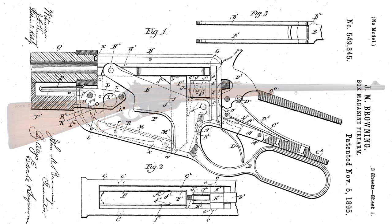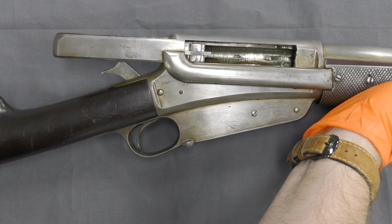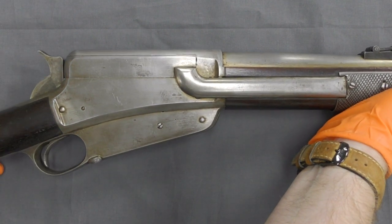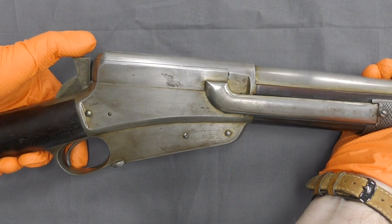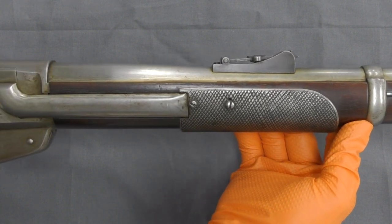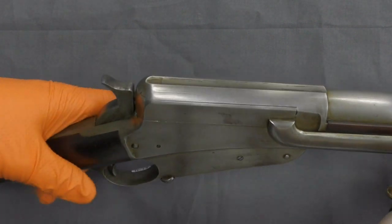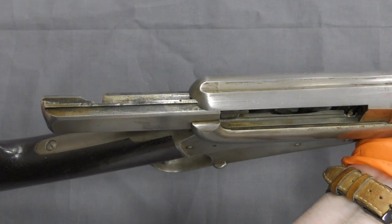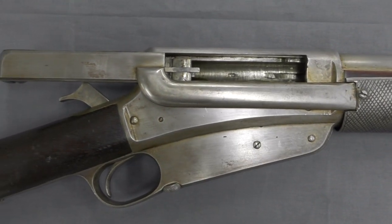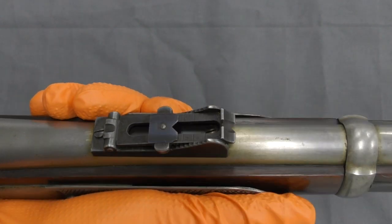The September 1895 slide action rifle design featured a laterally camming locking breech block. Externally, Browning's tool room prototype looks somewhat similar to the contemporary Model 1895, with a single-stack integrated box magazine but with a pump or slide rather than a lever. An action bar connects the slide to the front of the breech block on the right side of the rifle. The slide handle itself is made of a U-shaped piece of metal which wraps around the rifle's forend, with a roughly cross-hatched surface to improve grip. There is a channel cut into the furniture for the action arm's attachment point to travel forwards and backwards, and the slide is attached to the arm by a pair of screws.